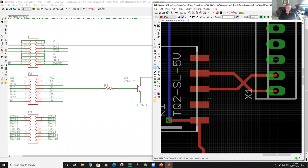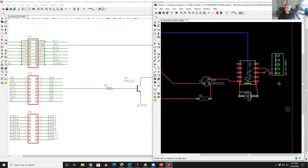If this is a through hole relay, I could put this whole thing on layer 16 on the bottom and it would be fine. But I can't. So what I'm going to do is move this guy over, then say change layer 16, or I could say change layer bottom, and tap on these two signals, and so now it's fine. Now they're not shorted together because the blue's on the bottom, the red's on the top,